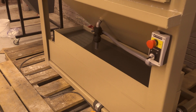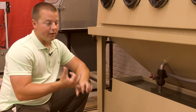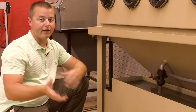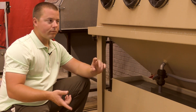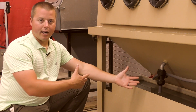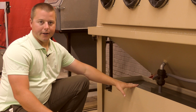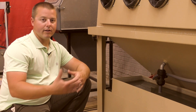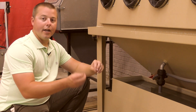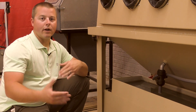It's really a set-it-and-forget-it system. I highly recommend it for anybody getting into this process. I know it's a little bit more money, but it's going to be worth it down the road. You're not using as much water and you're not wasting as much abrasive in these cabinets. And specifically, if you're using some type of additive — whether it's corrosion inhibitor or any anti-clumping compound — you're not going to be wasting that product. You're going to be able to use it in these systems because we're using the same water from the hopper in these bins. So you're able to conserve and save a lot of money with a closed loop system.